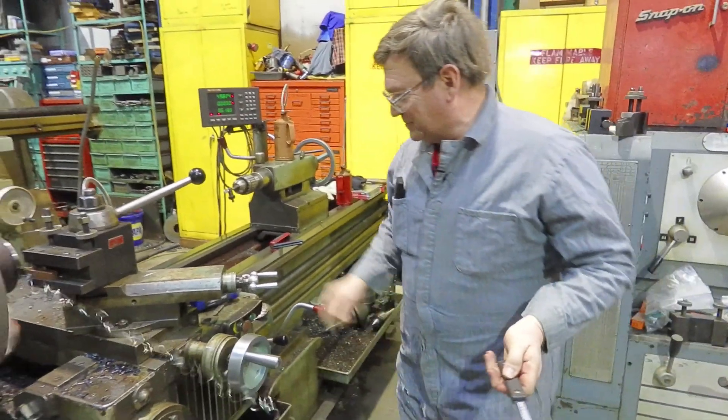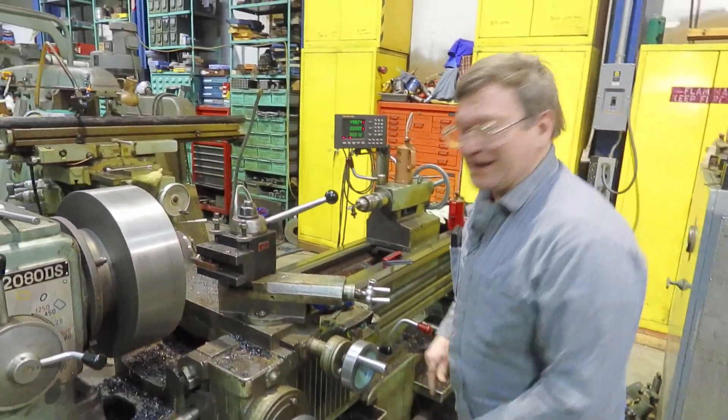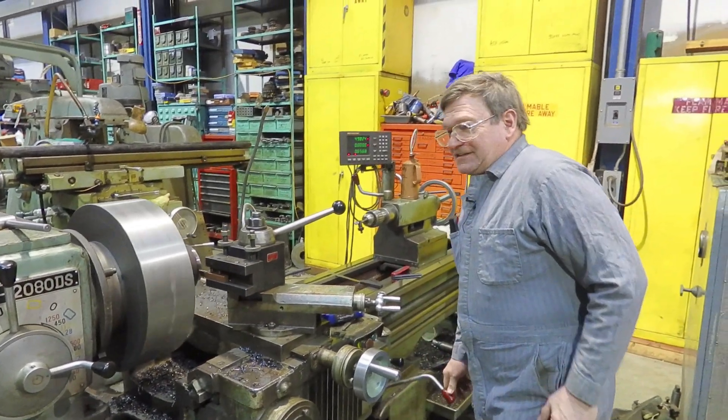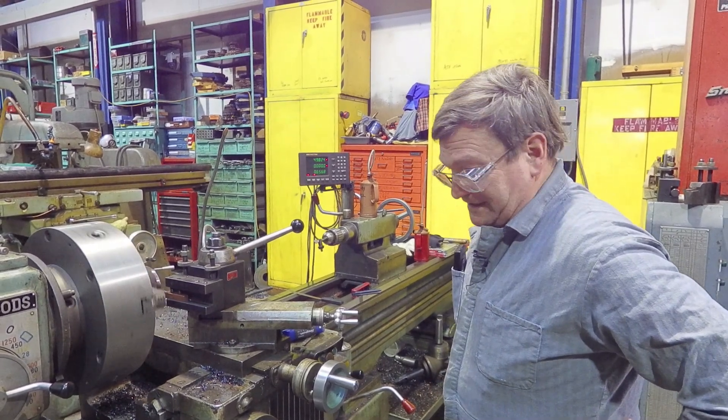Making some somewhat nasty chips. I'm going to stop it — let it cut itself off this time so I don't break the bit. That is a combination of things. Your speed and feed is the biggest one that does it.